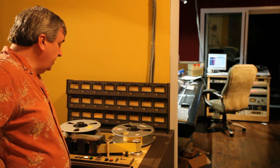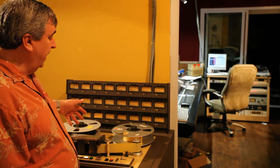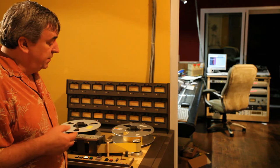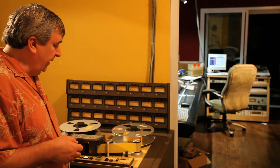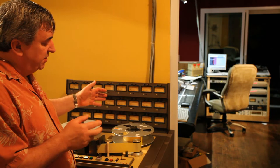We're now at the final reel transfer. We baked this yesterday, cooled overnight, and I've just laced it up and put it on the machine. Out of the four reels that we've been through, when I did a closed loop spooling — where I took all the tape out of the path of the guides and anything that would rub against it, and just spooled it to let some air into the tape — this one was the first tape to really exhibit the stickiness. As it was spooling through, you could just hear and see how the tape was sticking.